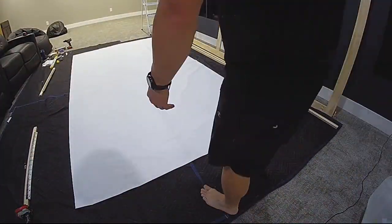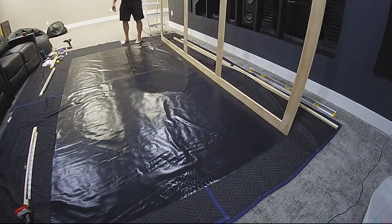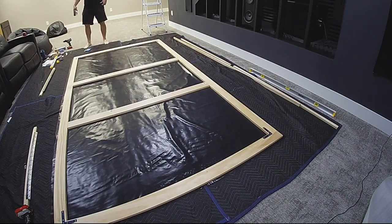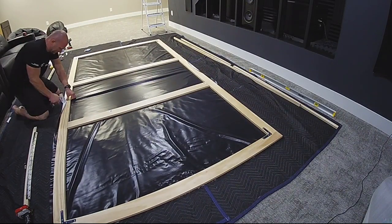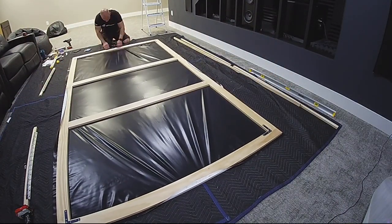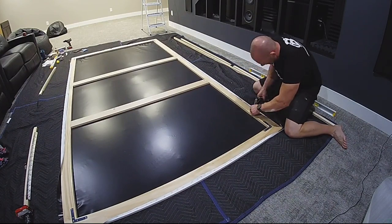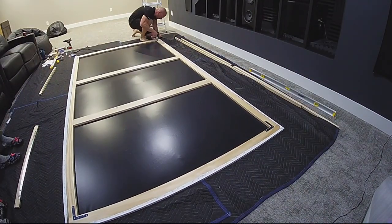This is the flexi white material that is acoustically transparent, purchased from Carl's Place. Unroll it so that the black back of the screen is facing up, then you can center your screen frame on top of the material. This material is very stretchy so it is best to start at one side attaching a few staples then go to the other side and repeat the same process, slowly working your way around the entire screen. I found that if you pull outwards towards the corners while stretching the material it helps to remove the wrinkles and get everything nice and flat. The corners can be a bit tricky — I would suggest trying a few different ways of folding the material before you start stapling everything down. Also, after you are all done stapling it down you may have excess material that needs to be cut off. Be extremely careful that you don't cut into the front side of your screen.